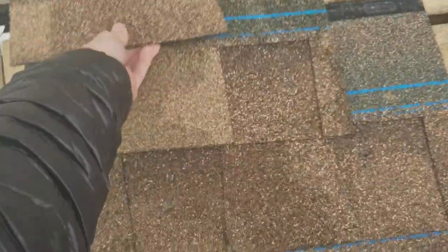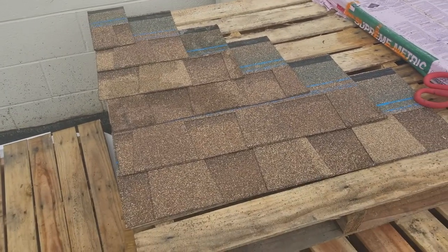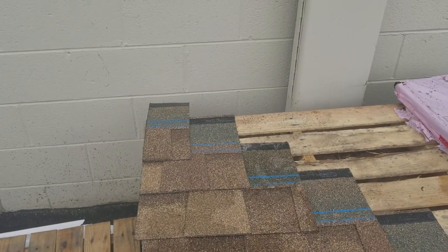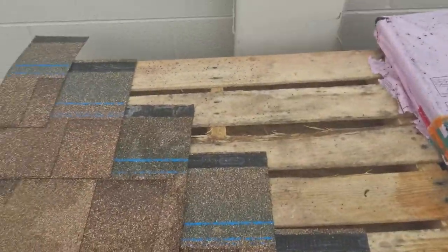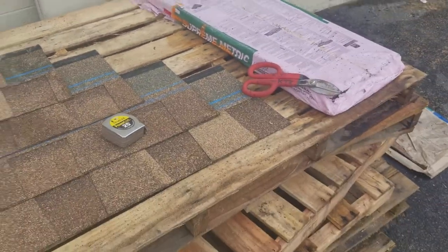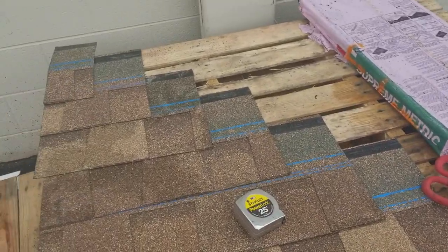We'll have 5 5/8 spaces all the way up the shingles here. And you can see here on this one that I cut, I was cutting it, we'll hang onto the camera and stuff in a little while. But this gap there on that last one, got about 5 3/4. So that one's just slightly off, but that's close enough. So long as they're all 5-inch minimum piece, should be good, and that's how you cut a book.